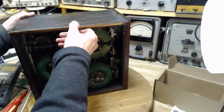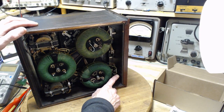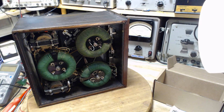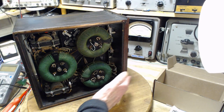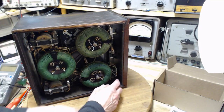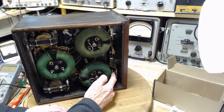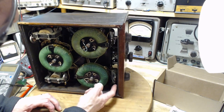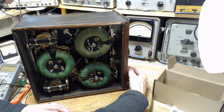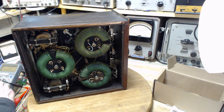It can't be a contact problem with the two tubes that aren't glowing. Maybe we can fiddle around with the control rheostat and see if we can't pick up power there, or do an ohmmeter test with it — do something to prove that this is conducting current in its proper way. That shouldn't be too tough. Got two wires coming to it. The slider goes one way is maximum resistance.